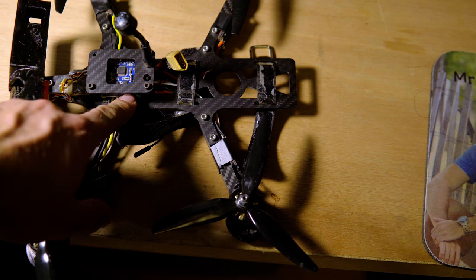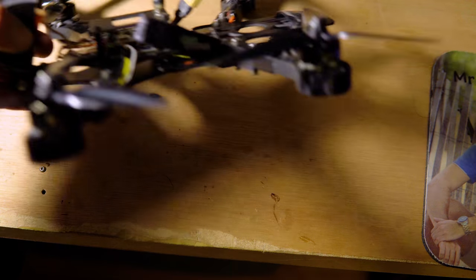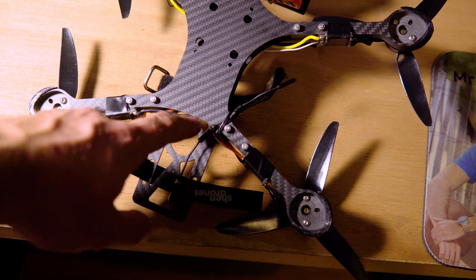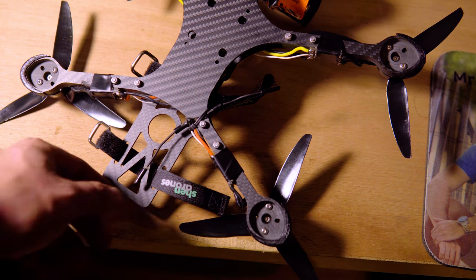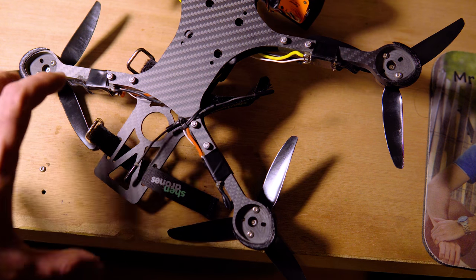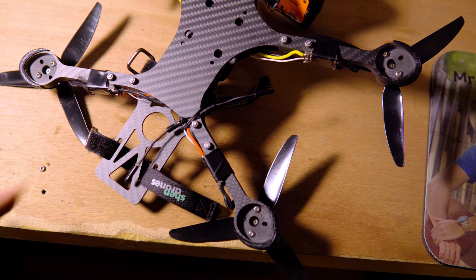There's a power distribution board in there. It's the Ready to Fly Quads one that I always use, and an XT60 for it. It's down kind of in the side, it's going to be really hard to see. Actually, impossible to see. I'm not going to bother, but right there is a TBS Micro Crossfire receiver, and this is a TBS Immortal T antenna, which, again, is probably not the most efficient placement for the antenna, but it gets the job done, and I'm not really shooting for super long range with this. It's just what I use on my non-racing quads, the TBS Crossfire.